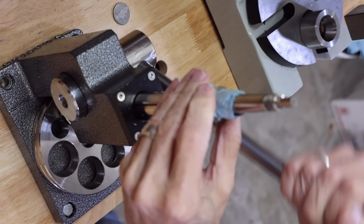All right, so I went ahead and annealed again, and let's see if this helps at all. It felt kind of like it was work hardening. So let's see what we got now. That feels a little better. I think that's probably okay. I'll go ahead and Swedish wrap it. But before I do that, I think I'm going to pickle this. So I'll be back with you after the pickle.